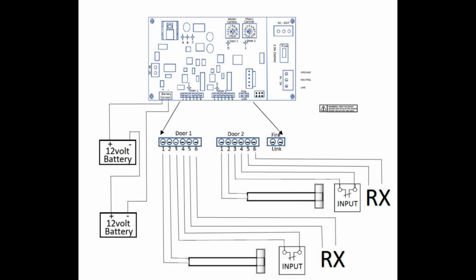So I think it's, hey, listen, let's try it and go from there, because you can hopefully put Humpty Dumpty back together until a motor comes in. My guess is that it is a power supply, and let's assume that there's a problem with the potentiometers as a result. You get a good power supply there, and now you can control the amount of travel on the worm screw, which controls how far you're sucking back the latches ultimately. So there you go.